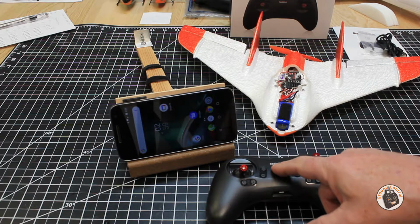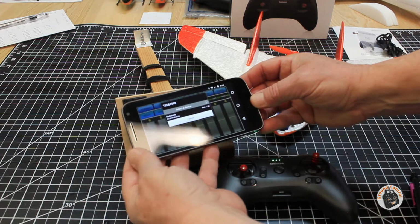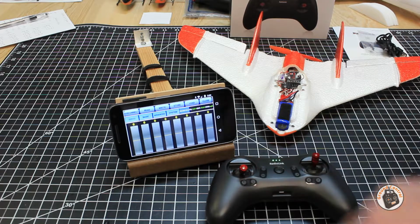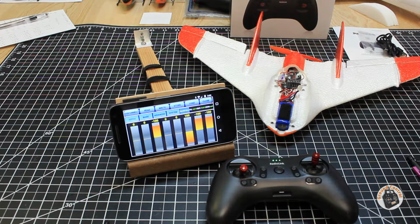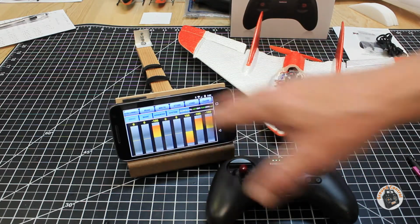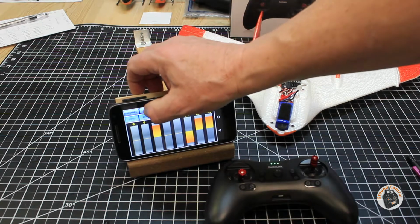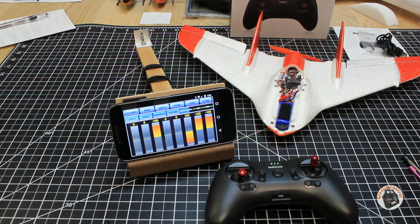Power it back on. Alright, and it's going to ask you what you want to connect to. Radiolink. Now if you're like me, you hear the transmitter beeping, just press any button to confirm you want to connect, and now you can see the channel monitor comes up. Now when you first connect with the phone, the phone just brings up the default configuration. It hasn't actually read anything from the transmitter yet. So what you want to do is select read. Okay, and then the transmitter is beeping. Okay, so it's read the information.